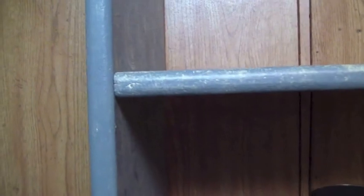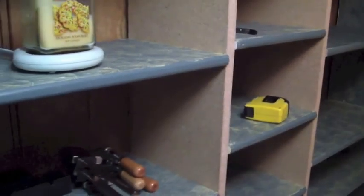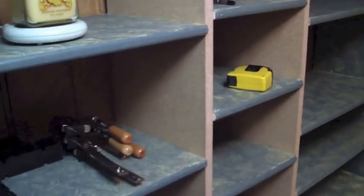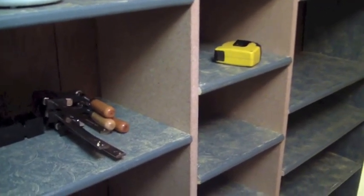I forgot the uprights — I did not like that at all. The top: I kind of screwed up without thinking. I have it rounded off on all these boards, so I have this weird little gap, and this joint here is not flush because they both round in different angles. I wish I would have either cut these boards back farther so the whole thing recessed back in, or cut it all square and hand-sanded or face-trimmed it. Looking back, I really wish I would have face-trimmed it, but that would have taken a lot more wood that I didn't have — and this was free. If I was going to build something nice I would never start with particle board, but if I was, I'd face-trim the whole thing, which would give me a lot more support.